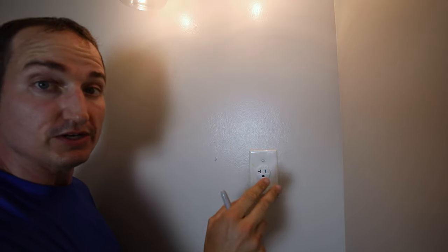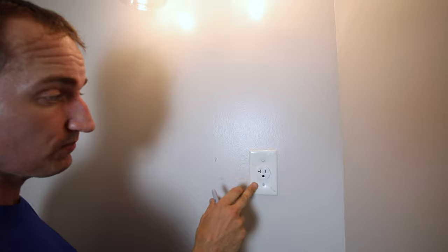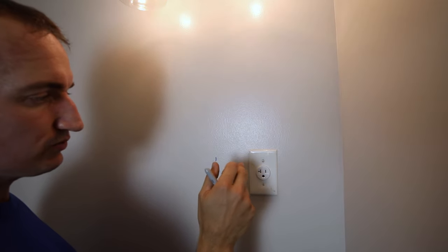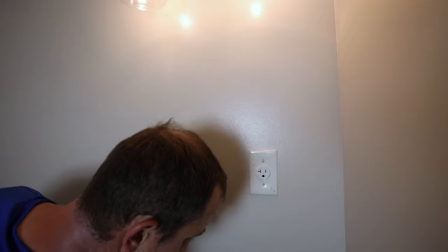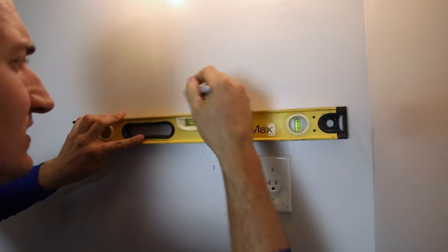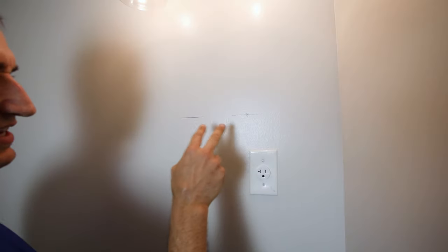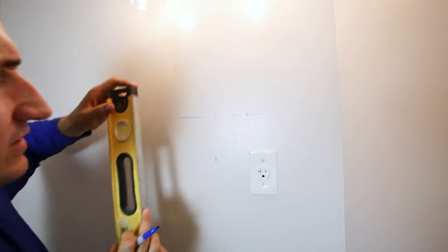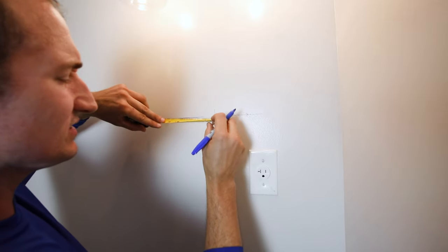To get my measurements I'm using the outlet box as a reference point. I know it's my center at 12 and a half inches off the wall. The top of the mirror will be about seven inches above this box, and the framing is positioned accordingly. The brackets are about three and a half inches above the outlet box, so I make a mark three and a half inches above it, use a level to draw a line, and mark my center point. From center, I go three and three-quarter inches each direction to locate the bracket positions.